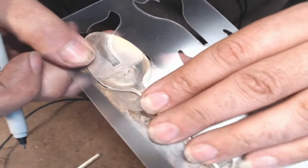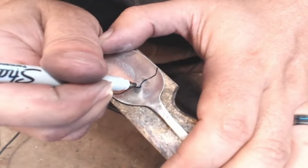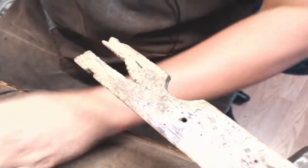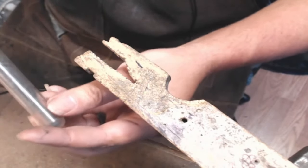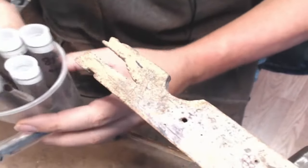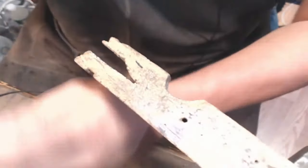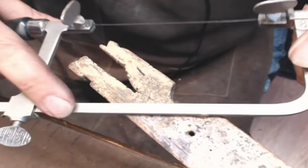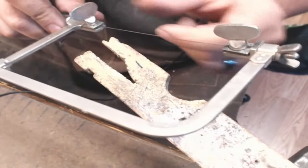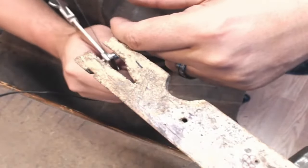This one looks like it will work for the teaspoon. I'm fixing these centers and I like them to go up a little further. I'll be using three-ought blades - I always keep out the one that's in the saw. I have a whole set of tubes from about four-ought to eight-ought, but this is what I have in the jeweler's saw right now. This was a cheap one off eBay that's adjustable, allowing me to use shorter blades. The teeth are pointed down so on the downstroke you're actually cutting.